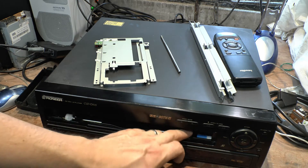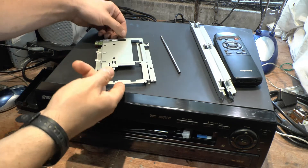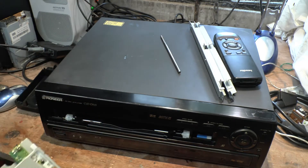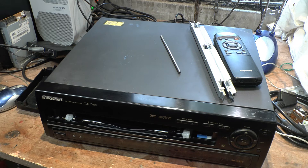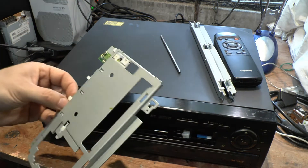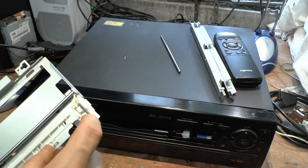I've had a quick look at this machine and I don't think I'm ever going to be able to get it to do dual side again — the bottom gearing is absolutely kiboshed. I don't have another one of these dual-side machines. I have the 390, which we showed here in a teardown and rebuild. That one is an NTSC-only machine — it won't do PAL. I could do something there with it, but I have another idea for this machine and I don't really want to damage the 390.